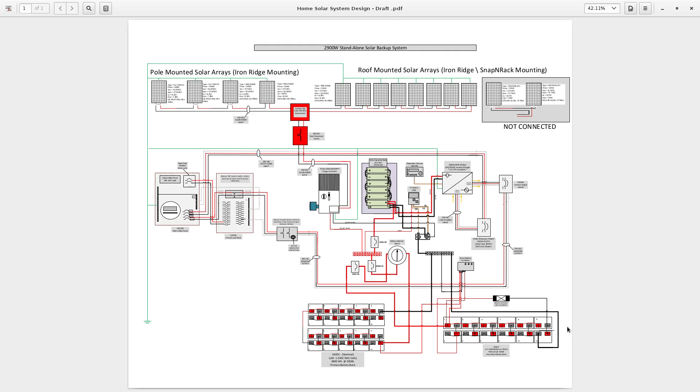Because the secondary is a lead-acid AGM battery bank, I need a way to keep the batteries from sulfating to increase battery life. That is done through this Battery Life Saver unit. Like a pulse-width modulator, it sends pulses to the battery bank to shake up the electrolyte and keep it from sulfating. It is connected to the positive and negative terminals of the battery bank so the pulses travel through the entire bank.